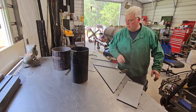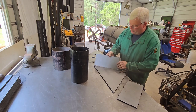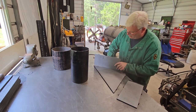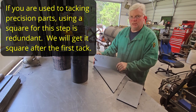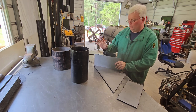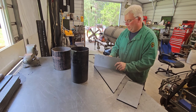We've got our parts in place and we're ready to start tacking this up. Essentially, I'm going to take one of the sides — doesn't matter which — with the base clamped down so it's not going to wander. Slip it in, hold it up tight into that gap, and use a small square to make sure it's 90 degrees to the base plate. Then we'll put a tack here and a tack there. Those tacks are going to pull it in just a little bit, so run some real small tacks so you can bump it back out if needed. We'll do the other side, flip it over, and put some tacks on the outside to hold everything steady.